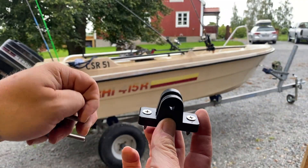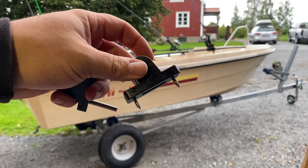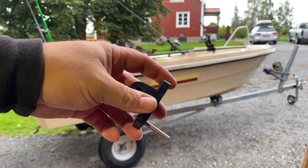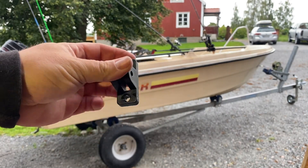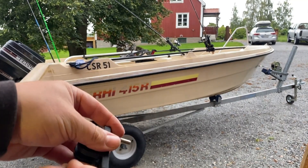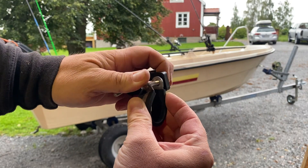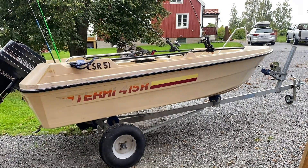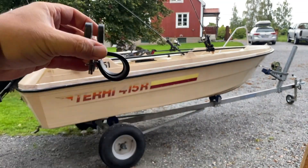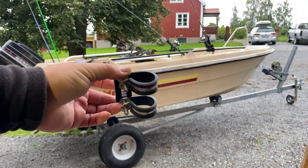This is the plastic foot — it's made to be mounted in a fiberglass or ABS plastic boat. But because I'm going to mount them on my railings, I bought stainless hardware to use. I had to drill them out and countersink them so the bimini top doesn't catch when I fold it, so they go in like that. Then these rubber clamps go through the railing. I got two for each side — I'm going to clamp it to the black railing so I can move it forward and backward as I want. Then I'll drill out the other one and mount these two.